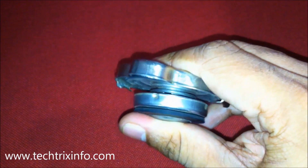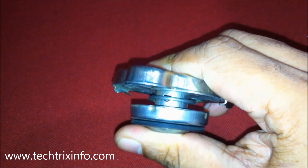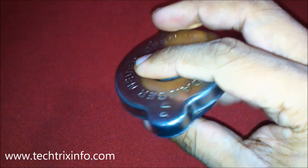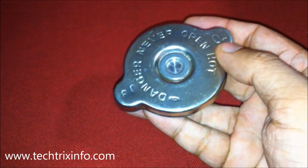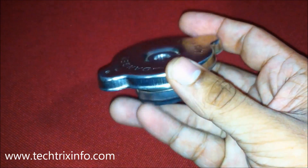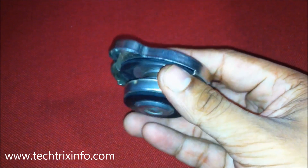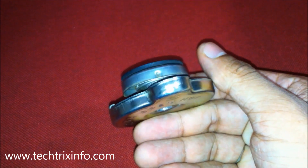It's very important that when you have a failed radiator cap, you replace it with a genuine radiator cap. Do not use a duplicate cap or close it with anything that seems suitable, because the positive pressure will not be maintained. A duplicate system will not have this valve mechanism, and that can result in engine failure due to overheating.